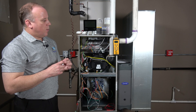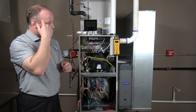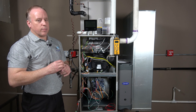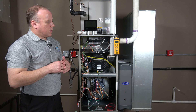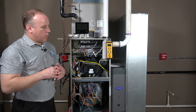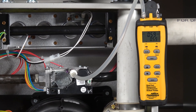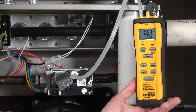Right now through the manometer we're showing about 1.54 — that's still in the mid-range startup. You'll generally hear the difference once the furnace scales back to minimum fire; you can hear the change in the burners and the inducer slowing down. Usually that happens within about a minute. Checking the manometer now, we're at 0.58.